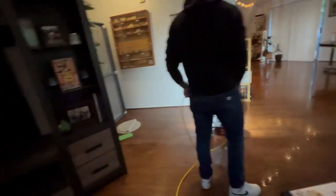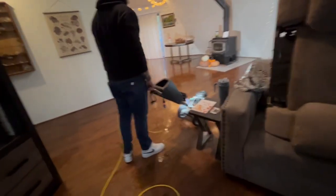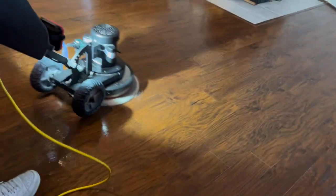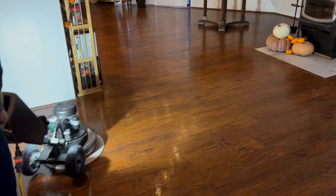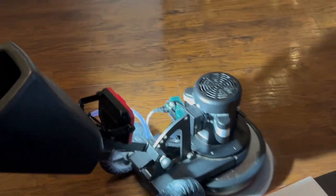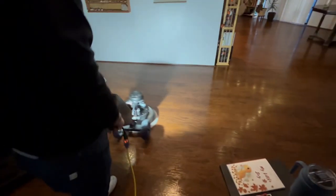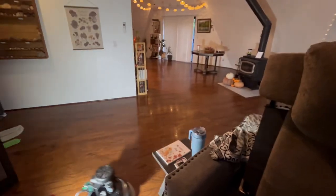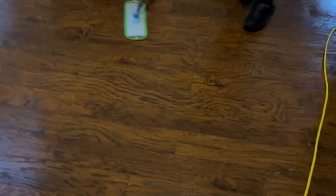We take a red pad — but first we dry mop it. I have a Bona dry pickup pad that goes on the bottom of my 18-inch flat mop to get all the dust and any loose stuff up under the toe kicks in the kitchen and all around the wood. Then I spray it with the Squeaky Clean and run the red pad over it to scrub and break down all the soil and dirt. The red pad is almost like a green Scotch-Brite pad but red — it's made for deep-cleaning surfaces, gets down in the grooves. Then we extract all the loose soil with the Iron Man pad.